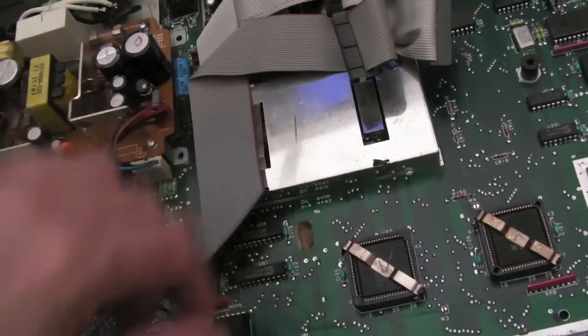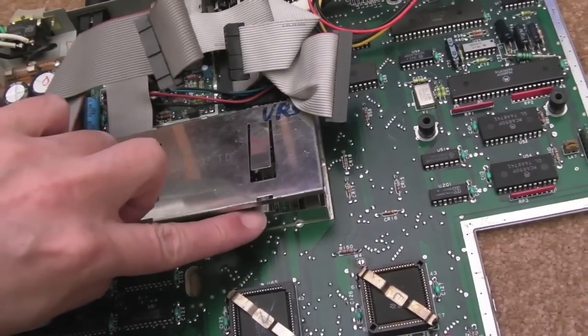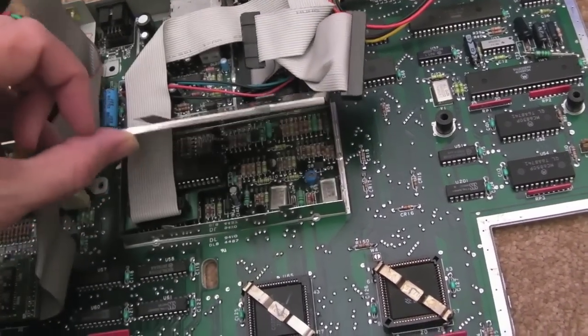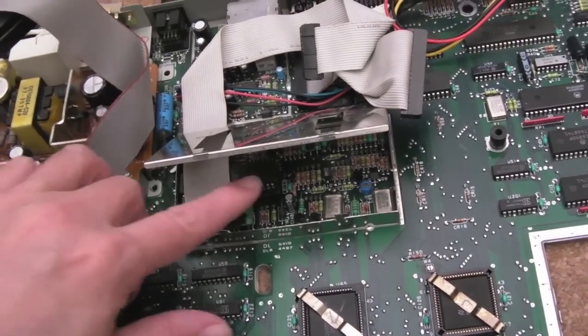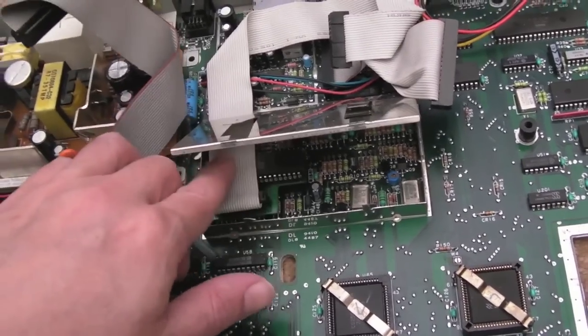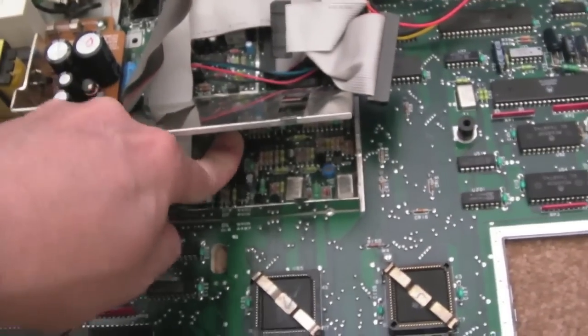And then the other one is under here. As I've shown on the previous ST Teardown video, you just have to bend those little twists there. And as you can see, you've got the Video Shifter, which is socketed. Mine's got this little board here. The normal scenario would be just this chip right in the socket. And again, it's just a case of pressing down, making sure it's in the socket.